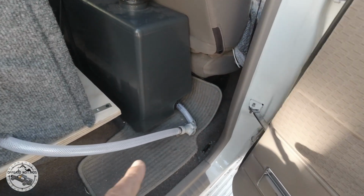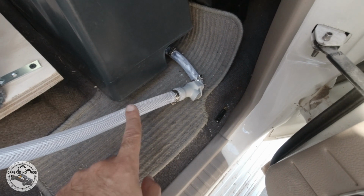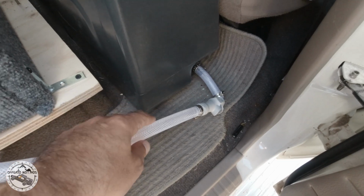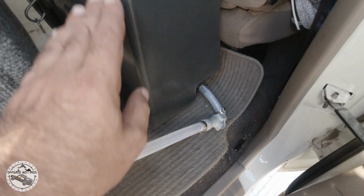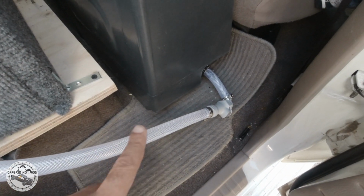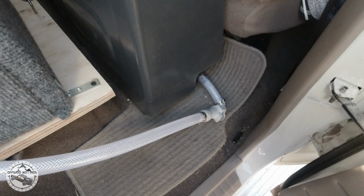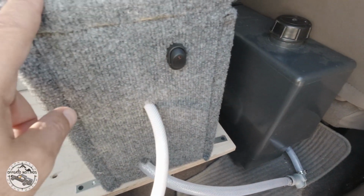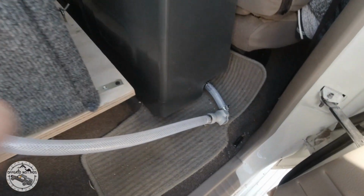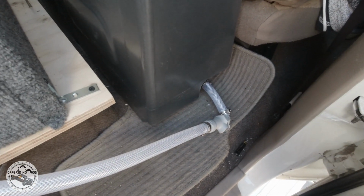Another advantageous thing that I have about the connection here is I can always quick disconnect this part, connect this hose into a longer hose that I can use to collect water from a river or a lake, which means the source of water can shift from the water tank that I have into a river or a lake using another hose and the same quick disconnect that I have. At the end of the water hose, I'll probably have a filter, and then that water will go through my main filter on top of that, and then goes back to drinking or using the hot water system. So I made it in a way where I could use water from the tank here or water from a lake or a river using a longer hose.